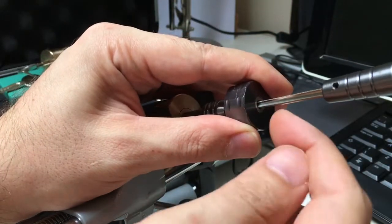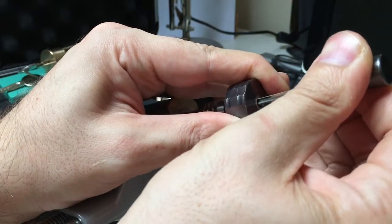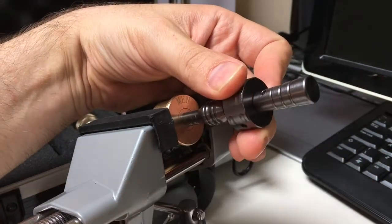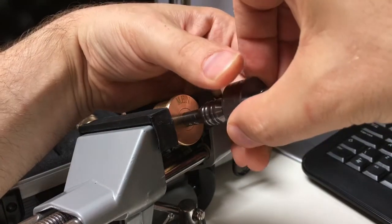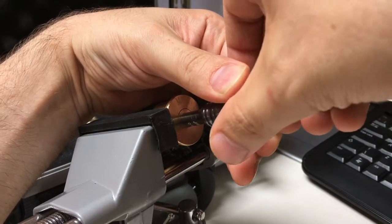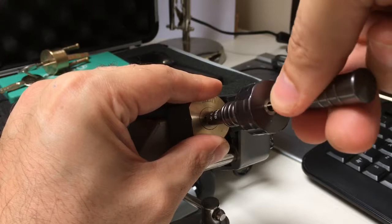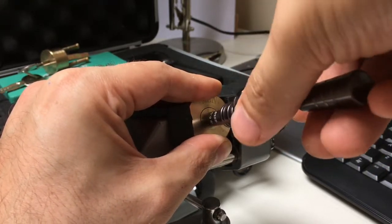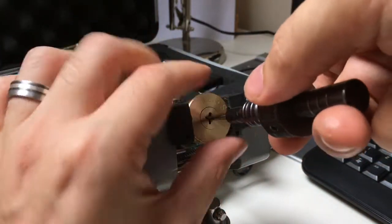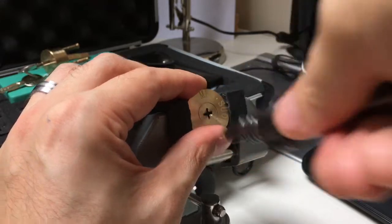Then what you do is put a little bit of pressure downwards on the collar and plunge into the lock gently, because you don't want to damage the lock or the blades — they are a little bit fragile. If you're heavy-handed, you'll end up having to buy a new set. Gently put some rotation on, going clockwise, then pull the plunger in and out while maintaining tension. And I've done it — if I pull that out, you can see that the lock itself has turned slightly. I'm going to try and extract the whole thing gently. I'll go have to turn it all the way — click — there we go, and then I should be able to move it. There you go.